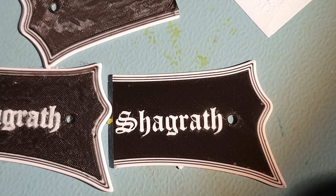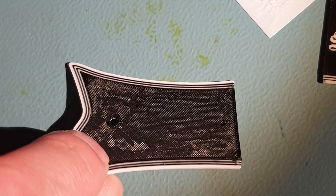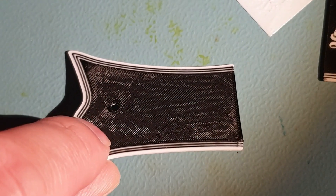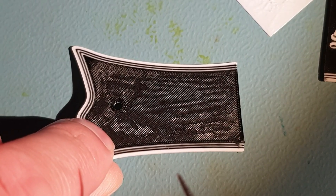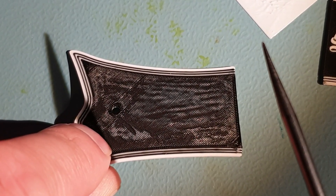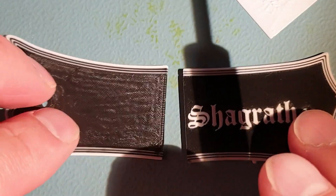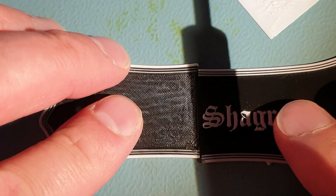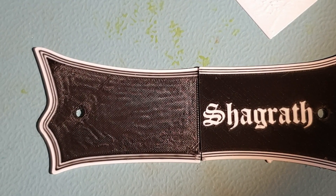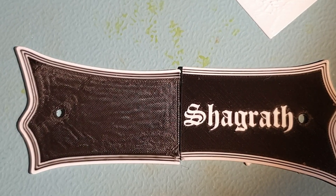So I just wanted to tell you guys: if you have these wavy patterns that look almost holographic on your 3D prints, make sure to recalibrate your flow values. Make sure they are below one, because if it's above one you're over-extruding — one is like 100%. If you're doing calibration, go down by one percent per step to get to the ideal value. Don't make the mistake I did and go above one in flow value for your filament, because as stated on Bambu's website, it is extremely rare that you actually need to go above one.